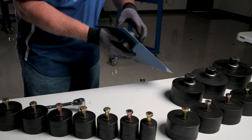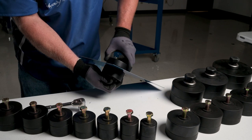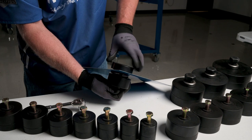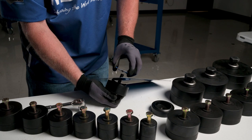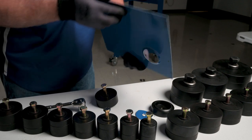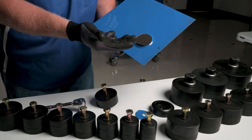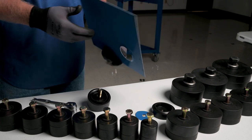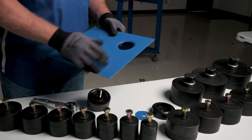Back it right off, hold the bolt, and spin the die part off. Our slug comes out, and then we have our punched and flared hole. It's very easy to do — nice-looking results, burr-free edge. Anybody can do it.